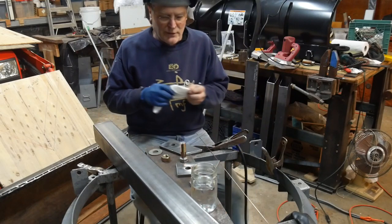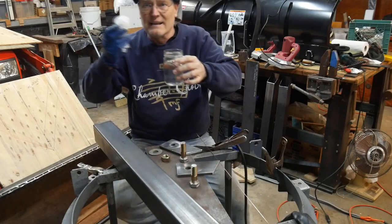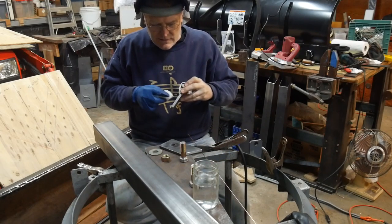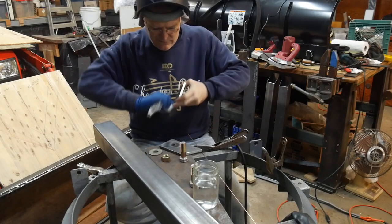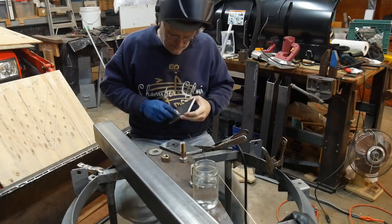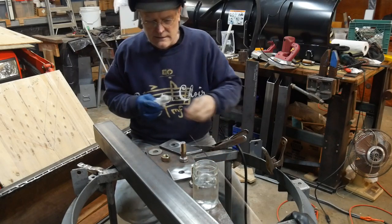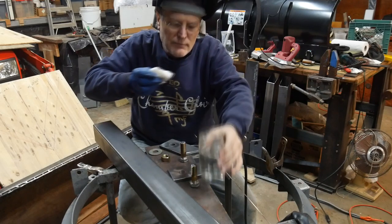It's time to first start with the dip – that's clean acetone. I'm actually going to set this aside for this purpose and get any oils out, also in the areas where it can seep up to your joint, which I have been very remiss about in the past. I'm reading a little bit more about TIG welding and getting things clean is extremely important.